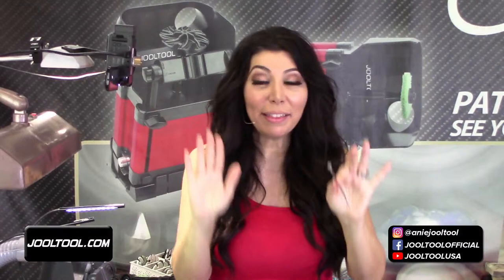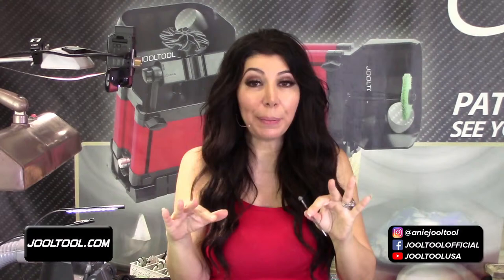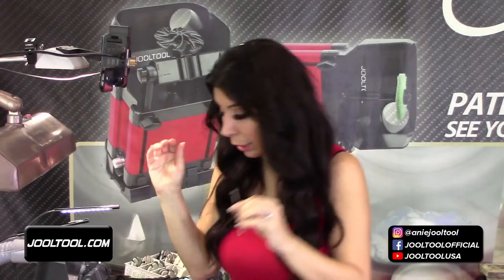So one thing you guys have to check out, and I did this just before we went on air, is the height of your stone with your tool rest. Before we get faceting, I'm going to explain something. You might have to modify your tool rest, depending on how tall the stone is. Mine is really tall, but if it's a shallow stone, you might not have to do this. I'm going to show you how to modify your tool rest to bring it a little lower.